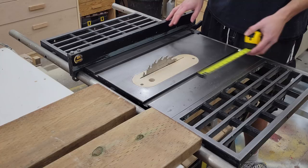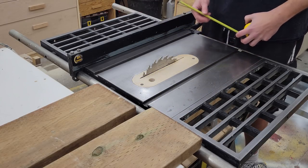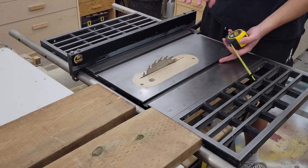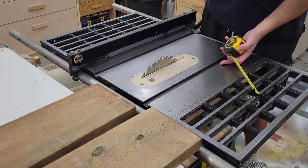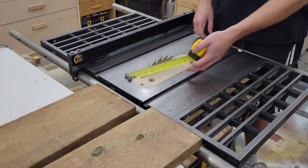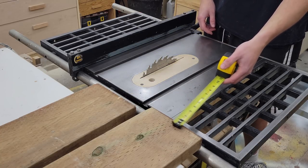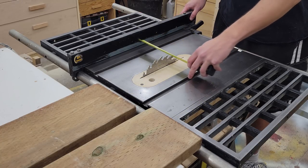Over here at the table saw, we're gonna rip down these 2x8s, which are 7 1/4 wide, to 6.5 inches, because the ramp needs to have a height of 8 inches. So the 1.5 inch thickness of the decking boards on top, we need to subtract from that. So that's how we get 6.5. So we'll rip those down, then we'll start cutting these up into gigantic triangles.